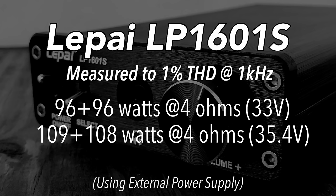We're going to try and measure the current draw for this amp, because someone's going to ask. We're testing at 4 ohms, 1 kHz, with about 35.4 volts going to the amplifier. The included power supply is only 3 amps, and we've already proven you really need more than that to get the most power out of this. We'll see what it actually pulls — starting the test now, letting you know when we hit 1% THD.